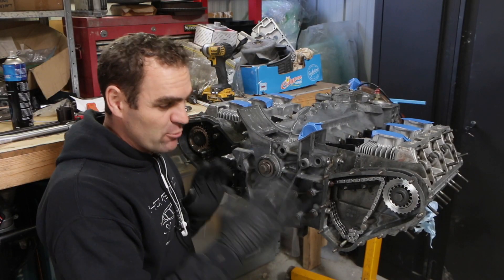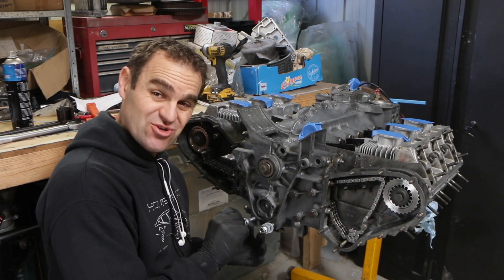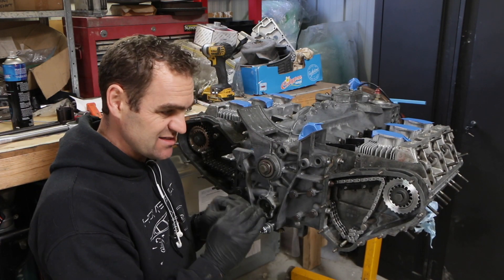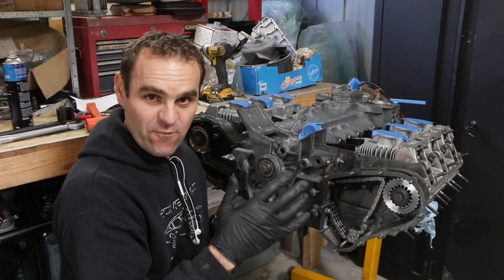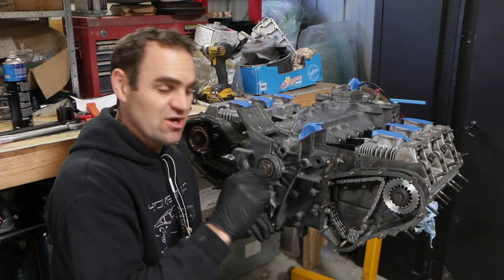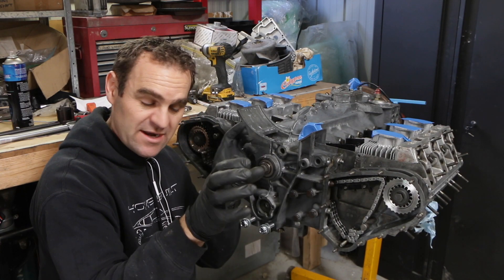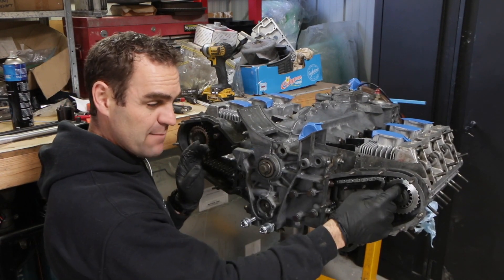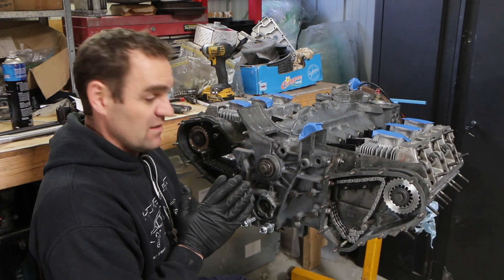After a lot of backwards and forwards making sure I was happy with how my straight edge was set up — using those bolts and a clamp to get it nice and square — I ended up taking two shims off this side. I was thinking I had to take all four shims off because I thought they were 0.25 mil each, but the shims are actually half a millimetre each. The tolerance is 0.25 of a millimetre, so you need to make sure these are within that. This side is now running two shims, the other is running three. This one is 0.1 of a millimetre out, this is 0.2 — both within spec. I'm happy with that, so moving forward.